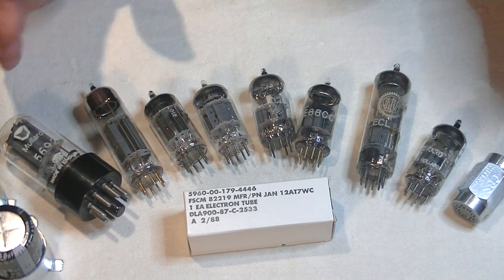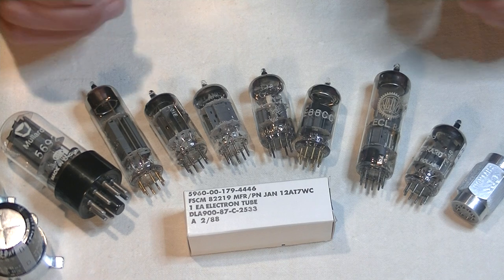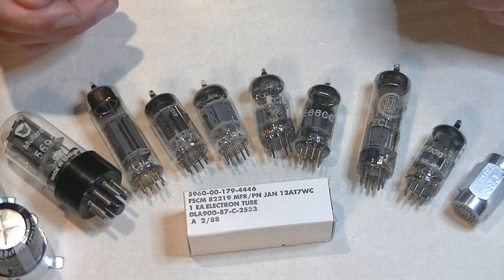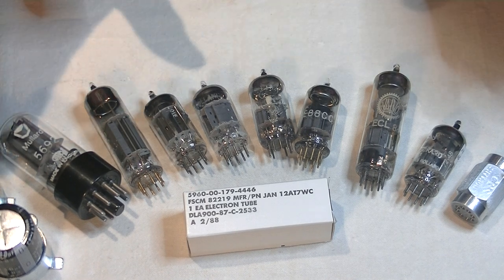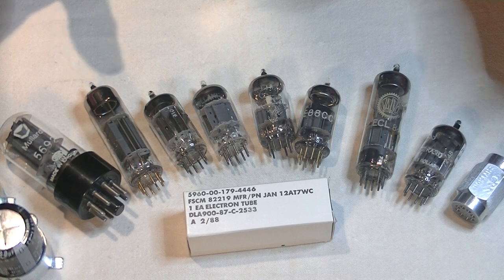So capital B meant Blackburn. So when you see Blackburn, you know that's Blackburn Mullard. The 8 is 1958, and the K should be November. Now, hopefully I got that date code right. I normally work in post-1960 Mullards.